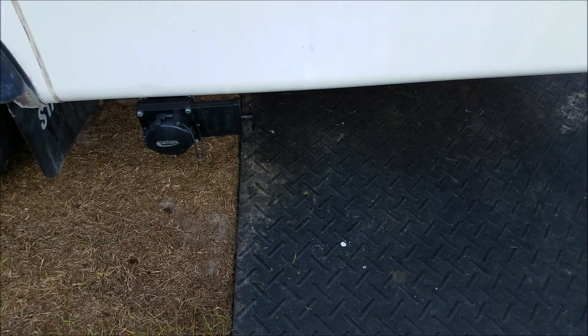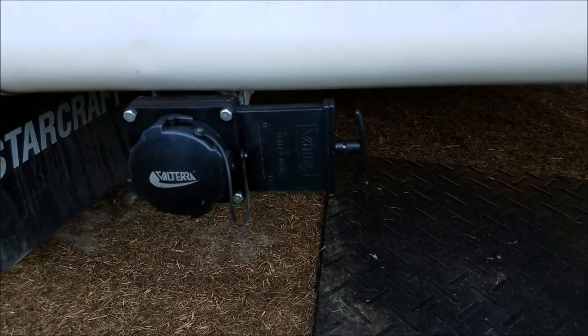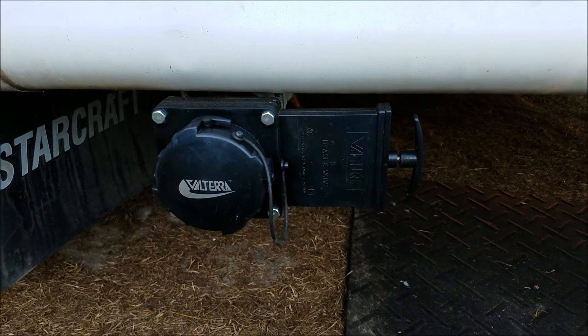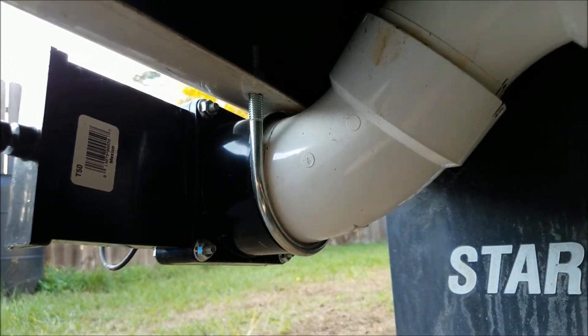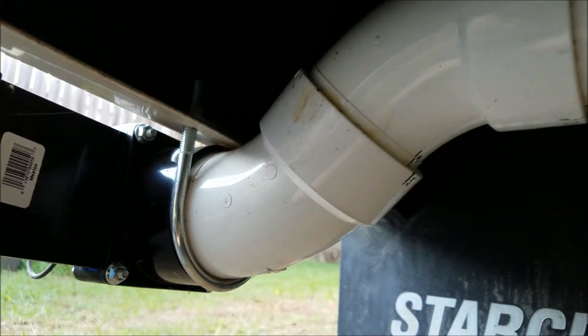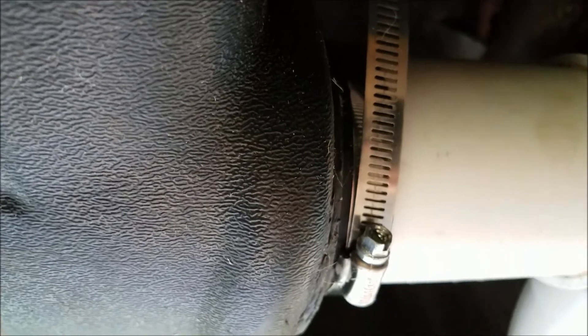Let me show you real quick how I plumbed and set up this black water tank. That's a standard valve I bought at Camping World — it wasn't that much, maybe 30 or 40 bucks for that cut-off valve. Let me show you from the back side. I was actually able to just hang the plumbing right under the edge of the shuttle, under the trim, using a big U-bolt — it seemed plenty sturdy. It's just standard PVC plumbing, a simple series of elbows into the back of the black water tank.